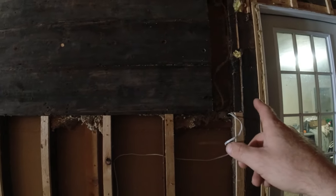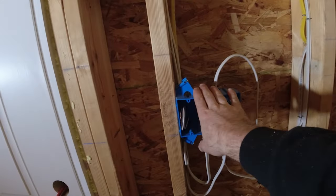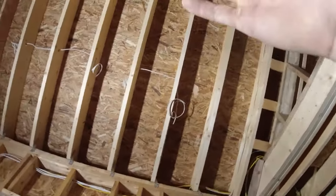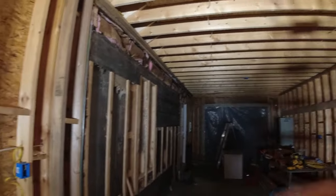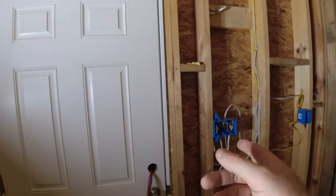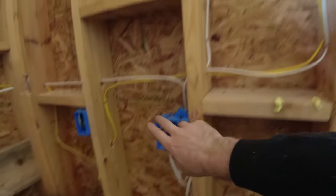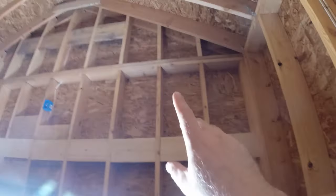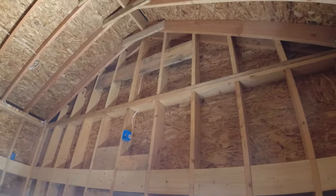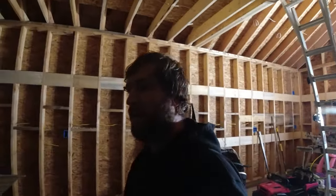which is going to power all of these lights in the parking bay. Then we'll run power from that box through this wall, right down here, around this corner, up into this light switch box. From there, we have power going to these lights here in the working area, another three-way switch to the parking area, the sconce lights outside, and then we have power going from there up around the door to this light switch box here, which will have the motion security camera light here, as well as another light up here shining towards the woodshed.